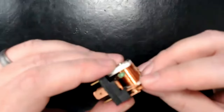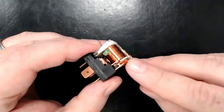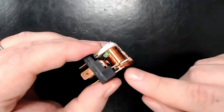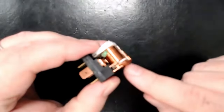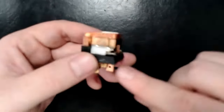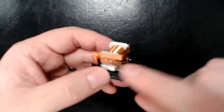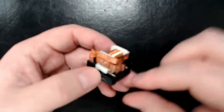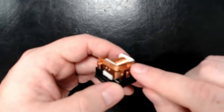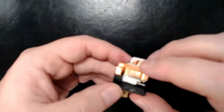The other part is right here in this corner. You'll see there are two contact posts coming up and then an arm that moves back and forth — this is your actual switch, the same way a regular switch works. The only difference is this electromagnet is going to pull this arm back and forth. Your braided wire coming around the side is actually your common; it comes up from this post and hits this back metal piece. There's copper that wraps around here — a piece of spring metal that pulls back against the magnet so it returns to its normal state once the electromagnet is turned off.